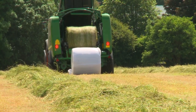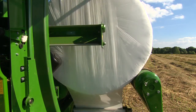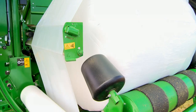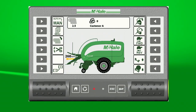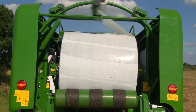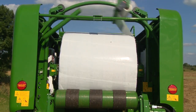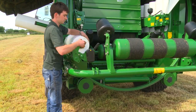The machine contains a number of innovative McHale features. The cut-and-hold system quickly and neatly gathers the film together at one point where it is cut and held. Its in-built film brake sensors, which immediately detect if the film breaks or runs out on either dispenser, alert the operator in the cab and automatically switch to single dispenser mode. When the remaining roll runs out, it signals the driver, who stops the wrapping process, to load the new film rolls.